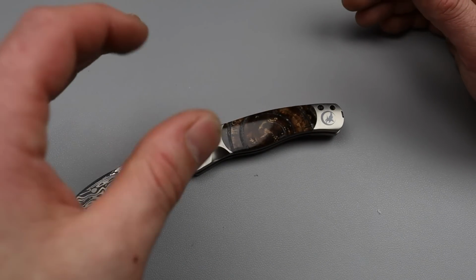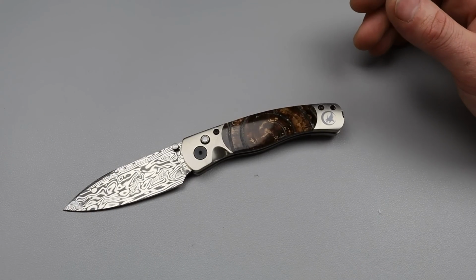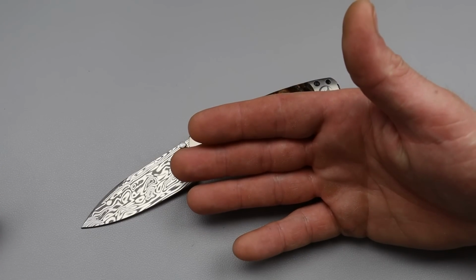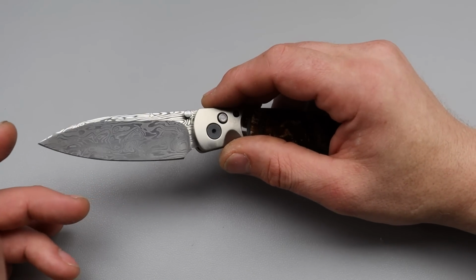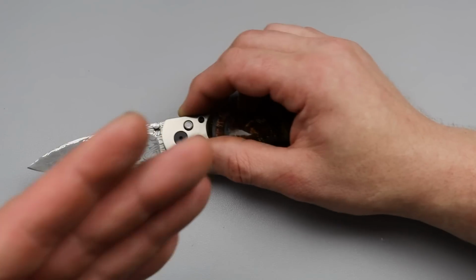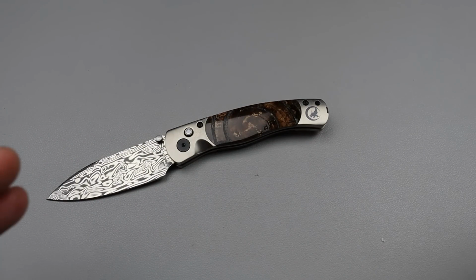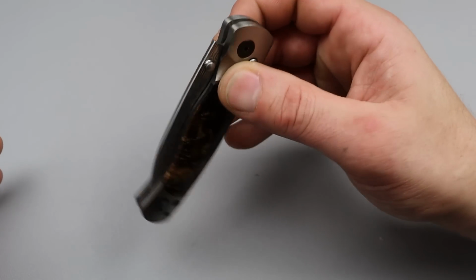Now, the grain structure is different. So while 400 grit might sound extremely toothy on one steel, having a 600 grit is like having 1,000 grit on other steels. That's the way you want to think of it. When you sharpen it, you can go between 600 and 1,000 grit, but 1,000 grit is going to be the absolute top, in my opinion, for any Damasteel that you're going to want to use, and you're going to want to hold the most amount of bite for the longest period of time.